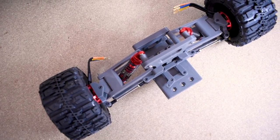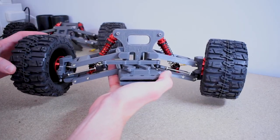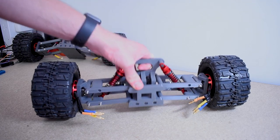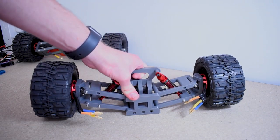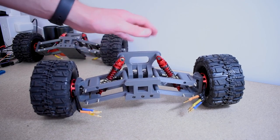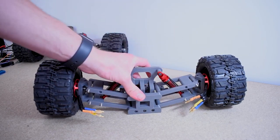For those of you that follow me on Instagram, you'll have seen that I managed to 3D print and assemble the front subframe. Everything fitted together perfectly and the geometry all seems to be good. The problem with this setup at the moment is that the suspension is just too stiff. The car already has a lot of unsprung mass, which is just inevitable with wheel-mounted motors, so ideally I want a suspension setup that is as soft as possible.